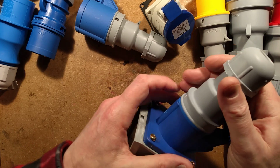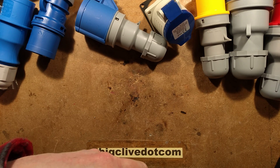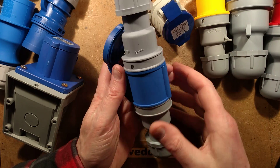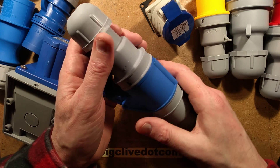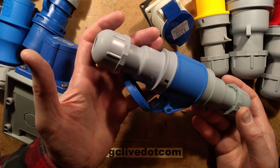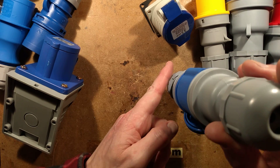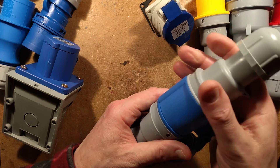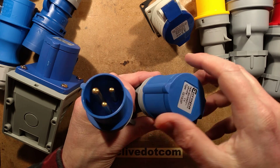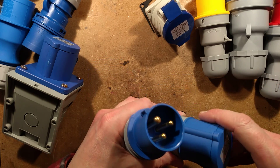Another approach is the surface-mounting unit that mounts on the side of an enclosure with the socket output angled down — so when you plug something in it sheds water in the correct direction. If you mount things so the socket faces upward, water tends to collect in the socket. Ideally you want it horizontal, or with the socket hanging down and the cable looping down from the fixture and back up so the plug faces downward, preventing water pooling in the rim.